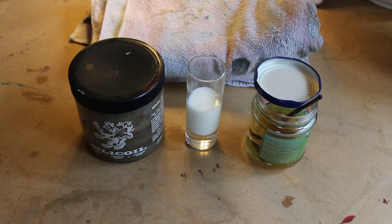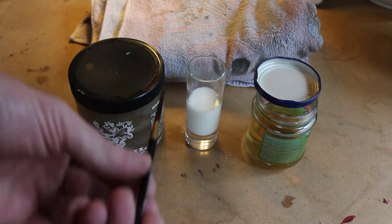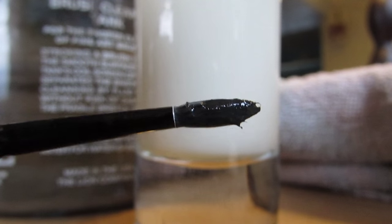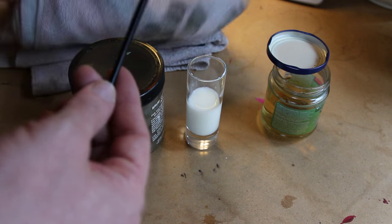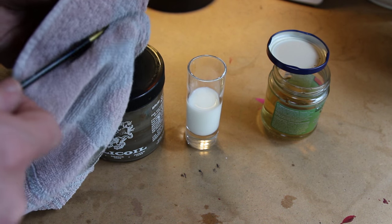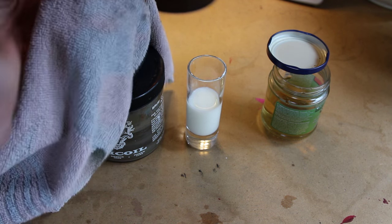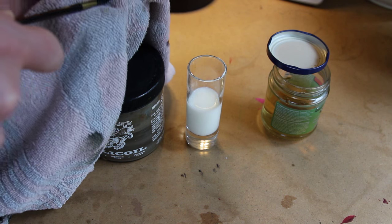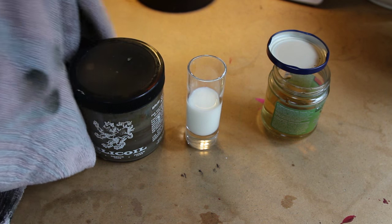It's been 24 hours now. We're going to take the brush out of the vinegar, and as you can see here, the paint has been eaten away by the acids in the vinegar — it's starting to peel away a little bit. What we're going to do now is take our rag and simply pinch with our fingers, and very gently begin to pull off that old paint. You're not squishing too much — just starting to pull off that paint.